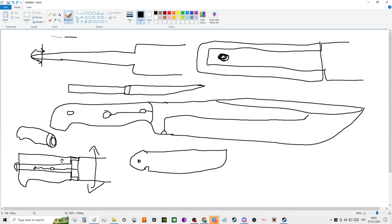Now, with raw materials or even antler, it does split. I sometimes like to put a little pin right at the back, just as a little added, just to take a little bit of the force away from the rear of the pommel, right? So that the blade isn't stretching itself out of that peen. Basically.